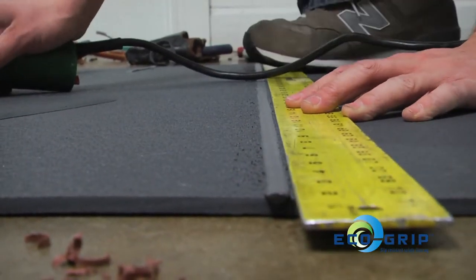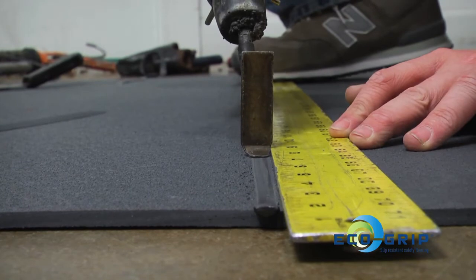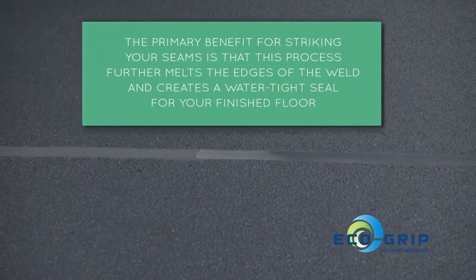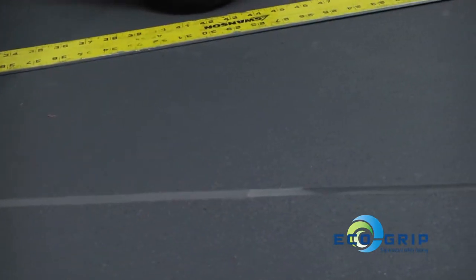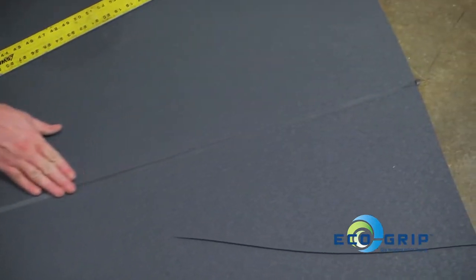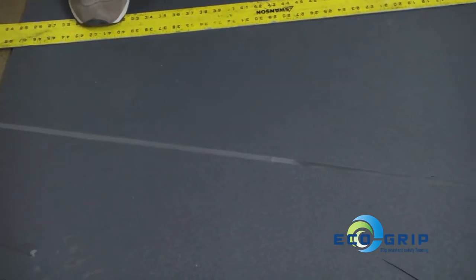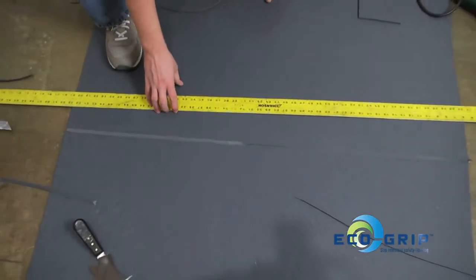You don't even need to touch the metal — you're really just blowing hot air on your seam to darken it up and give it color. You don't want the tip to touch much at all. You can see the difference where it's been struck versus where it's still raw — it darkens it up, gives it a little shininess, and kind of seals it. One thing about doing the strikes: it's best to do them all at once so they all look uniform. Shave all the welds, then come back with your welder turned up to 9 with a straight edge and strike all the seams so they all look the same.